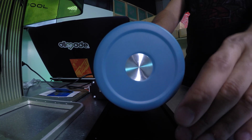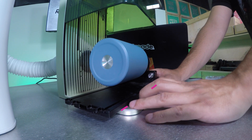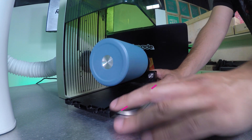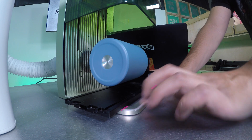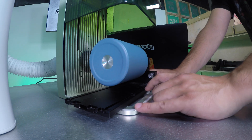I'm going to lock this down by tightening it. At the front of the laser there are these two wonderful lines that XTool provides that allow us to align the rotary tool to the laser. We just take those guidelines and set the edge of the rotary tool so that it matches up to those two guide points.